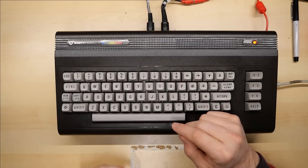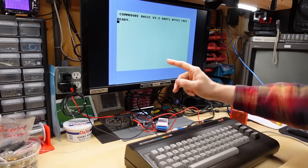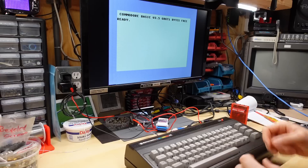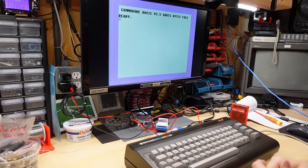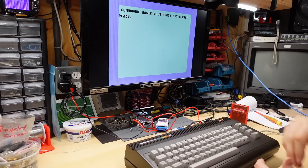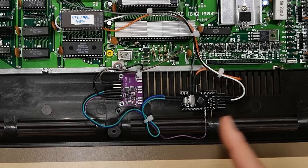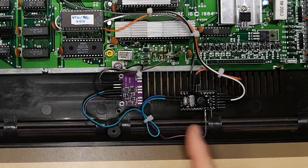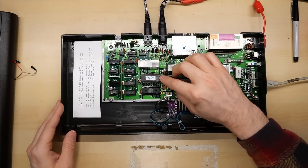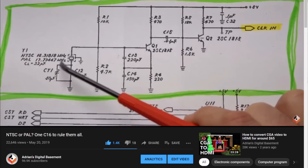This is my Commodore 16, which I've shown on the channel before. This thing's had some mods done to it, and one of them is I can switch on the fly between PAL and NTSC. Right now it's running in PAL — you can see the borders on the top and bottom are somewhat thick. If I hold down the reset button and wait for the power LED to flash once and let go, it will now switch into NTSC. The color purple is a little bit different and the border on the top and bottom is not as thick, which indicates it's running in NTSC mode, which has fewer scan lines. Removing the cover reveals the motherboard, where you can see some of my mods. This is an Arduino and a clock synthesizer chip, which is required for the PAL/NTSC switching. I also have a different EEPROM in an adapter that allows me to switch between the two different kernel images, and the Arduino is doing that. I have a video on this entire mod, which I will link to in the description below.